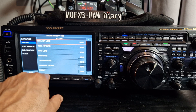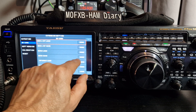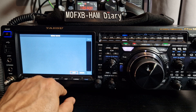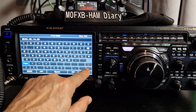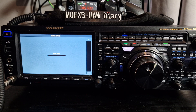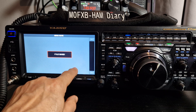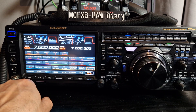We'll save something first — Memory Save, Load, Save — then do the firmware. Menu load, then menu save as a new file, leave the date, and press Enter. It's saving. That way you know you've got all the files there, and then you put it in the PC and transfer the correct main file from the Yaesu SD card.